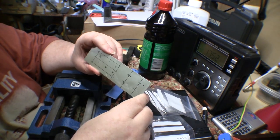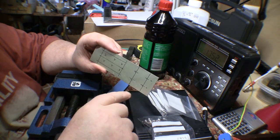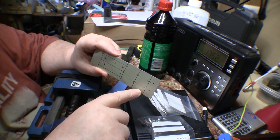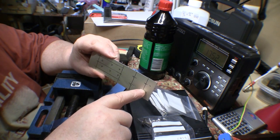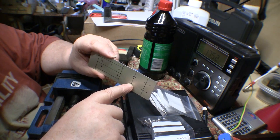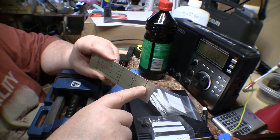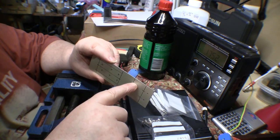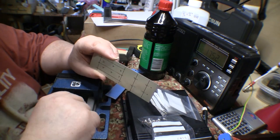This is the layout for the back panel on the aerial. This is for the battery compartment, then this is an earth socket here, just for putting in earth. The output to the radio will be here. A straight wire aerial can go in here so that you can bypass this whole thing, or a coax aerial. So these are two inputs, an earth and an output, and power.